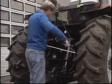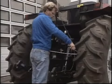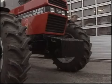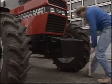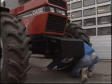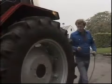For a plough to perform effectively, the tractor wheel settings have to be correctly adjusted, as they control the width of the front furrow. Depending on the type of plough, the inside rear wheel setting should be between 100 and 150 centimetres. The front wheels should be 2 to 10 centimetres wider to enable the rear wheel to follow the furrow wall. If the front wheel setting is narrower, the tractor will wander from side to side, creating uneven work. This is also true if the front wheel setting is too wide, as both tractor and plough will pull out of line, producing a wide front furrow.